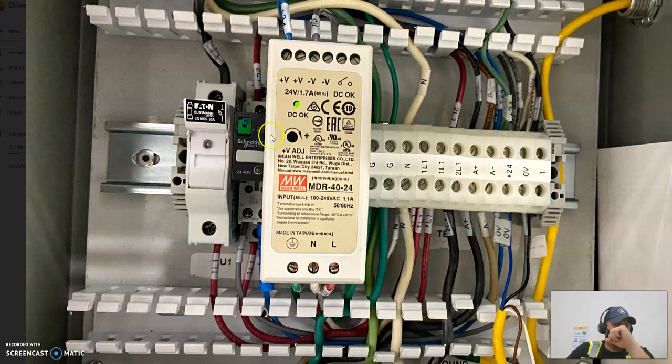If you come to your control box and the light is on and you don't have power coming through, you know with almost certainty it's going to be a problem with one of your switches. In this case it was. Our current switches like to strip and come loose — there's a jam nut behind the switch that likes to come loose, and that causes the switch to get stuck in the depressed state, stuck in the stop position. When that happens, the normal indicator light that shows you're in stop won't be lit, so it's a pretty big issue. You have to go check all the switches on the line and find out which ones are bad.